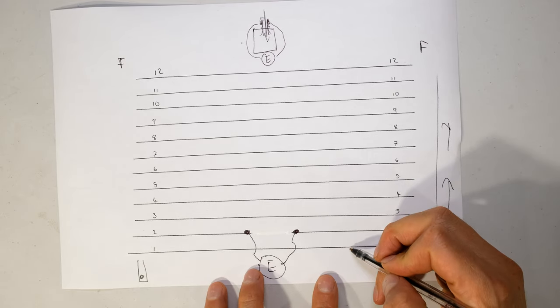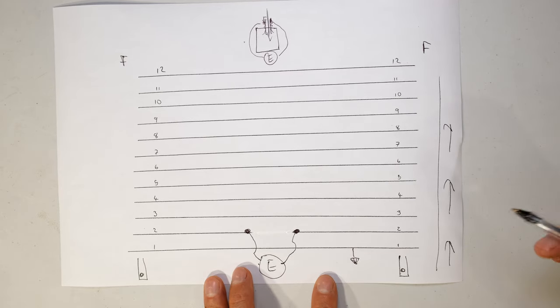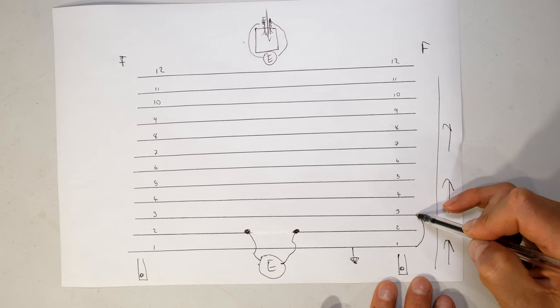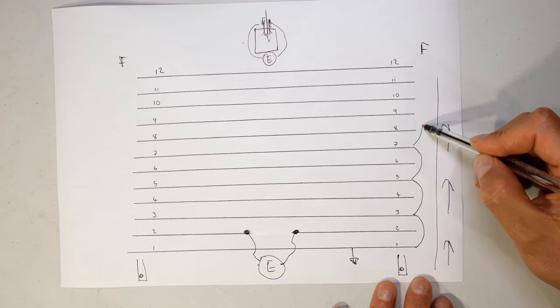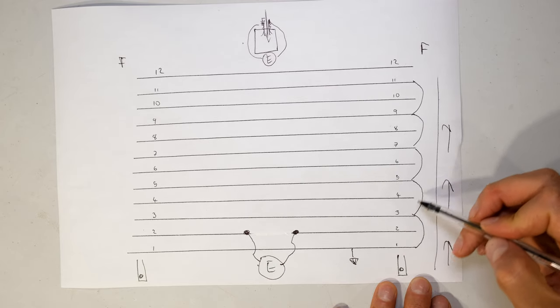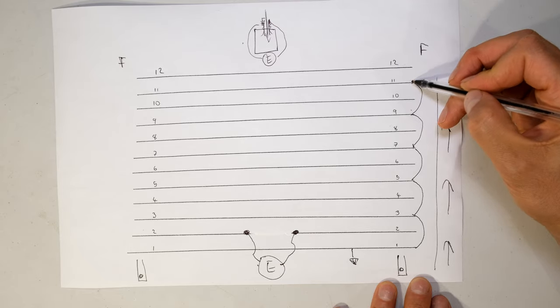You don't have to do it this way - there are many ways. Many people prefer to start the live wire on line 1 rather than having line 1 as earth. I'm going to do a more traditional approach and put earth on line 1. So let's link line 1 and line 3 together, and do every second wire to be an earth. As you can see now, lines 1, 3, 5, 7, 9, and 11 are all earth wires.